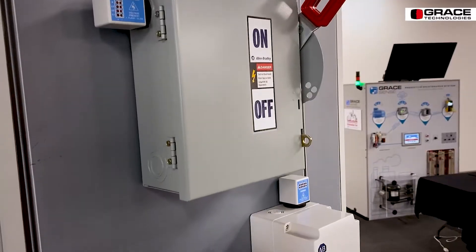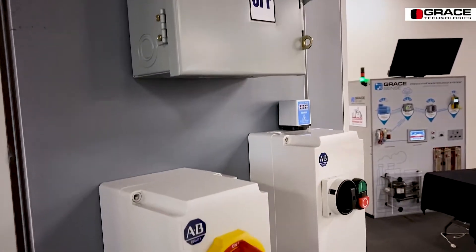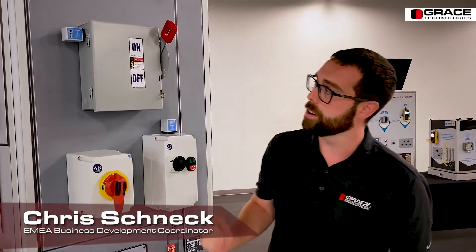Moving on from our standard R3W, this is our R3D2, our flex mount voltage indicator unit. The biggest difference is that it can be used in a three-phase four-wire monitoring application, but it also has the addition of the neutral, so it can be used in three-phase five-wire monitoring. Another key difference is that this uses a conduit hole punch knockout — M20 or three-quarter inch. We typically see this installed on smaller motor mount disconnects or smaller electrical control panels.